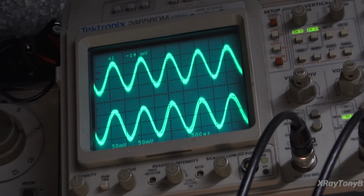So it just goes to show that even though channel 2 had problems, the bias circuit didn't work at all because we had 3 burned up resistors, 2 of which were open, the other of which was out of tolerance but still at least had continuity. And of course the bias pots were bad, just kind of grungy. We were unable to bias that amplifier, but even with that, take a look. So I guess the point that I'm making is that even though you might have some issues with your bias, you may not see it just by looking at it without actually measuring.